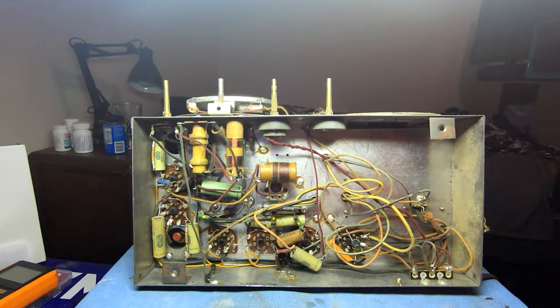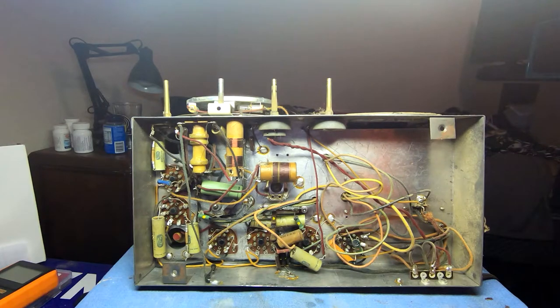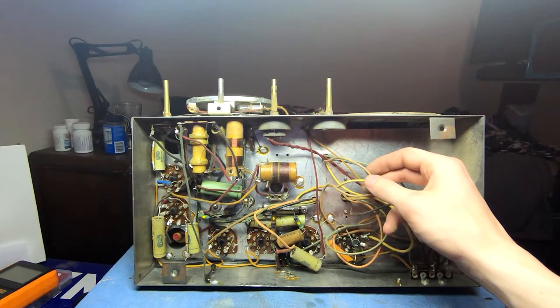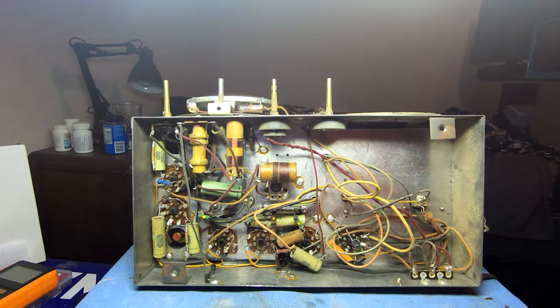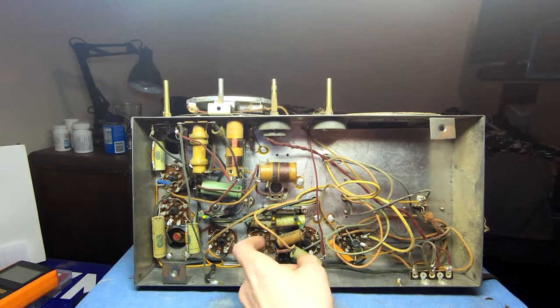Most of these are pretty easy to get to, though that one might be a little tricky — it's bonded to the chassis, so grounding it I'll probably have to clip off part of the lead. You're going to need a lot of heat to melt any of these blobs — a pencil-type iron is not going to cut it. We'll also need to check all these dogbone resistors; the color coding on them is in great shape thankfully. I have the schematic pulled up, but they don't have the color code, which is fine — I can pull up a chart. The only issue is all the schematic values were done by hand, making it a little tricky to read.